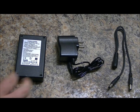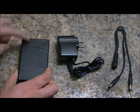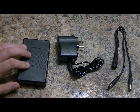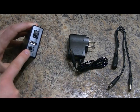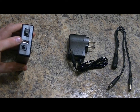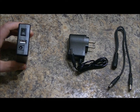More so paintball. So I'll turn it around, and I believe how it works is there are 5 levels of charge, and out of the box it's got 4 levels, so I imagine it's 10 volts. I can test that. I'll show you a little bit later how to test that, but this is how you charge it. You'd plug this in right here, and this is the input and output. So you charge in and you use this as an output to power your prop. There's also a 5 volt USB output, so you can charge your phone if you'd like. So I'll turn power off.